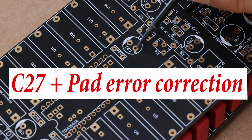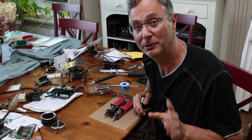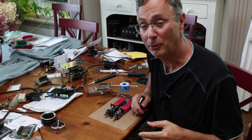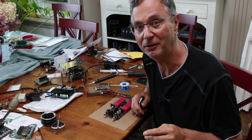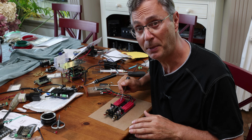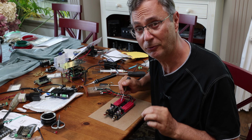Hi, this is going to be a very quick video about the little error on the board that I would like you guys to fix. It doesn't affect the sound, but if you have some very long leads, it may, and I would like you to correct it. Luckily, the fix is super easy, it only takes a few seconds. It's about the 15-volt supply coupling caps. One of the pads is not connected to ground. So I'm just going to show you how to do it super easily.